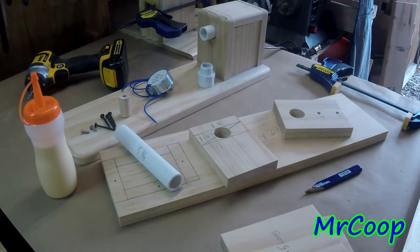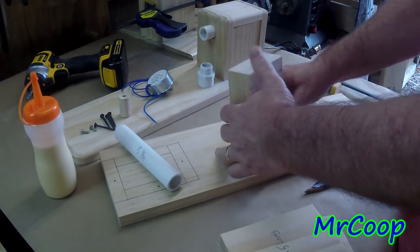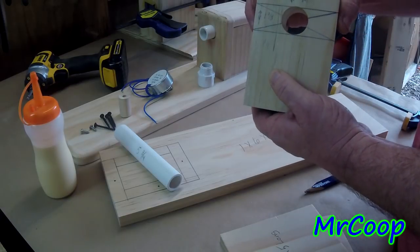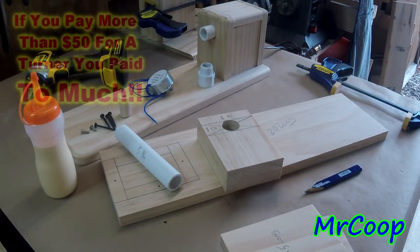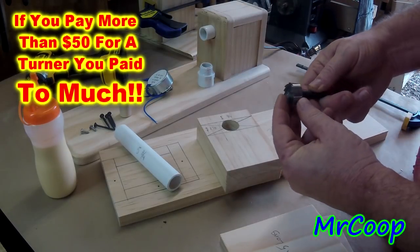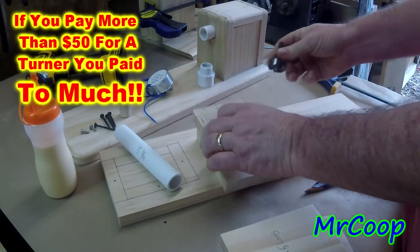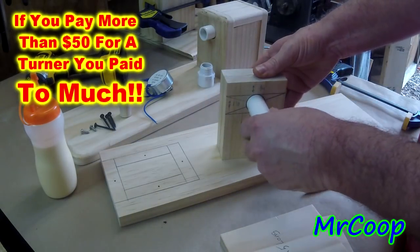Once you get the exact center of that board, you'll take the one you just marked up and another one and put them together. You can use double-sided tape, a clamp, anything to secure them while you drill, because you want to drill the exact same hole through both of them. Go over to your drill press and with a 1-1/8 inch Forstner bit, drill right down through both of them. If your drill can't get through both, drill through the top one enough to score the bottom one, then take the top one off and finish drilling the bottom one — that way both blocks will be identical and your pipe will line up perfectly.